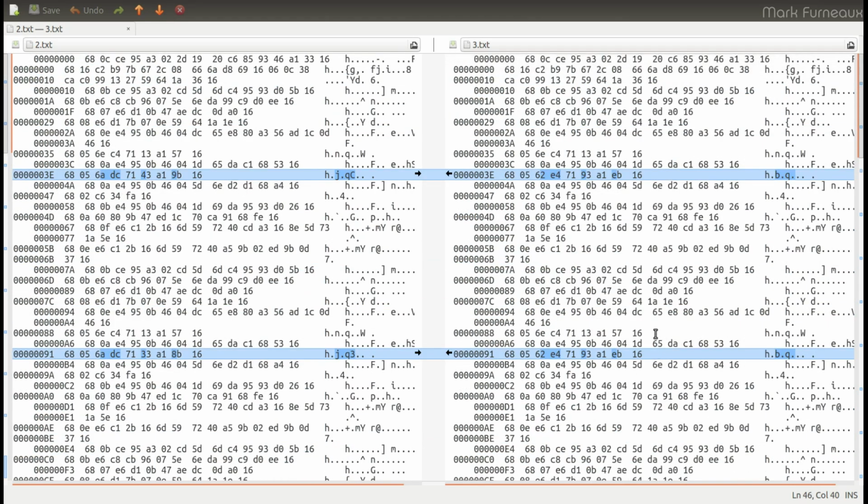So my immediate thought was, these must be the current temperature of the device, because everything else was the same, and the only thing that was different was the temperature that it was currently reading. So, just from that, I've identified which packet contains the current temperature, and which bytes in those packets correspond to the actual temperature value. And so now I had an in to figure out how their packeting and how their protocol works, because I have the temperature in degrees Celsius, right? I know what that is because that's what it says on the device.